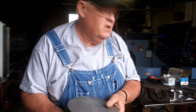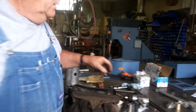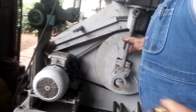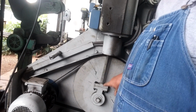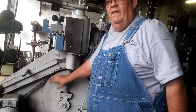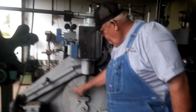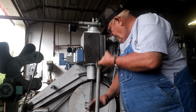How about the lubrication for the crank bearing at the top that we talked about this morning? This is the piston rod that goes through here. The reason that it's bolted together here, should you ever need to change the belt, you can simply take these two bolts out, then you can slip the belt over there. Otherwise, you'd have to disassemble the whole thing. So you take this in two here, and the belt slips on very easily. Get it over your motor, over the wheel, tension it up, put the bolts back in.